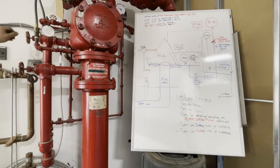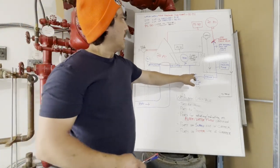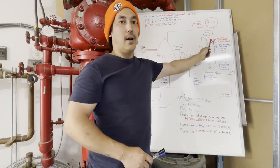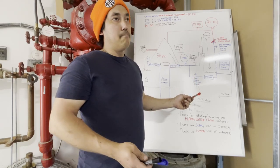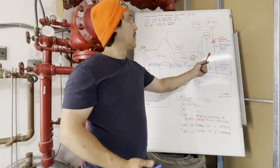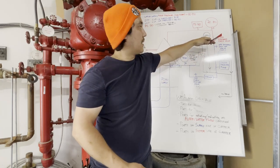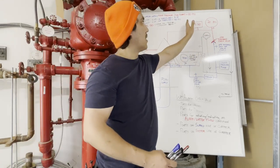Because this is a manual pump, I'm going to explain why these valves are normally closed. I only open these valves when I want to turn the pump on to pump up. As long as this discharge check valve is working 100%, I don't technically need to shut these valves. But because it's a manual system where I have to physically come and manually turn the pump on, we just like to shut these two valves as an extra added precaution — so in the event that the check valve doesn't work, I've got an extra valve to also isolate that trim piping. Essentially I've got three fail safes.